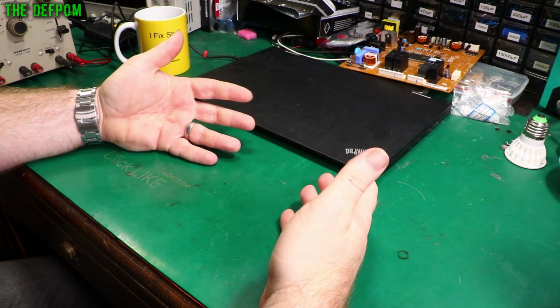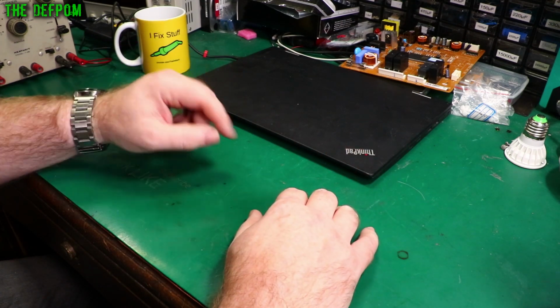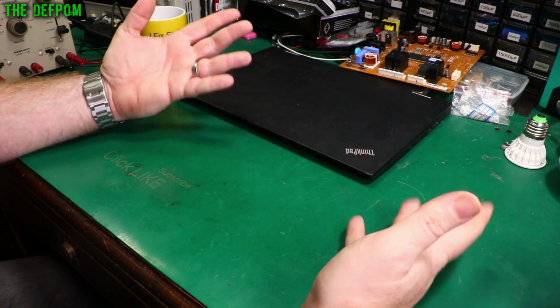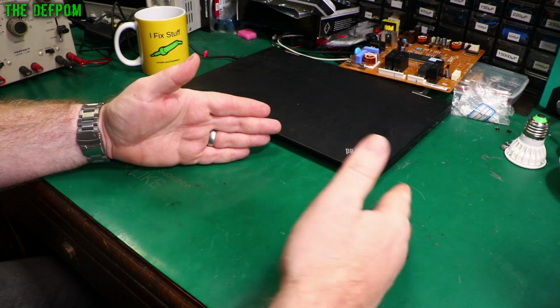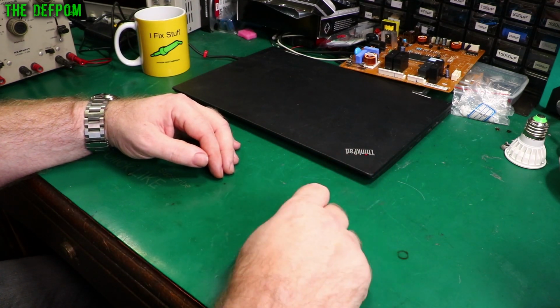And if you're doing any through-hole stuff, get some IC sockets. Definitely get IC sockets. They're really cheap. You don't need the round pin machined ones. They're nice to have and are supposed to be slightly better, but I've always used the cheap ones. They've always worked fine for me, and I've never had any issues with them. Keep a stock of those. Get a range of sizes from say 8 pin through to 24 pin or so, and some narrow and wide footprint ones.